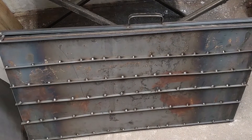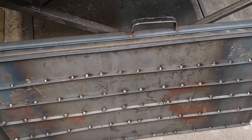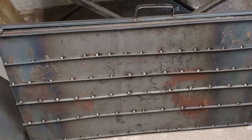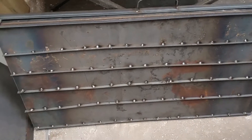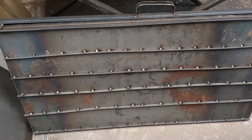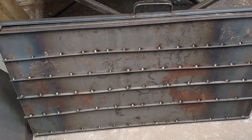Here's a look at the bottom of the cutting table. It has half inch by eighth inch spacers on the bottom. This helps keep the sheet steel from warping in the heat of the slag. This also keeps a gap between your table and the cutting table, which means you can also use it on a wood table without the slag burning the table.